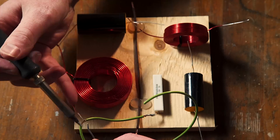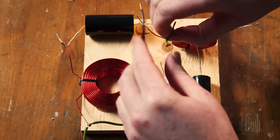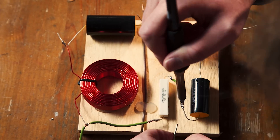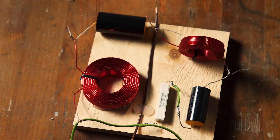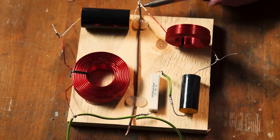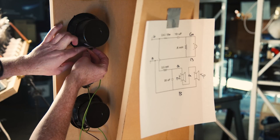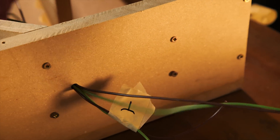When building a crossover with multiple inductors, it's important to set them up so the inductors don't talk to each other — not due to any fear of a machine uprising, but rather to prevent the two coils from creating mutual inductance by being oriented in the same direction. To avoid that, we're going to lay one horizontally and the other vertically. Then once you've soldered all the connections between your inductors, capacitors, and ground, you can place the crossover in the cabinet, mount your speakers, and wire it all together. To avoid excess wire cluttering up your interior, drop wires down from your speaker and cut them at the appropriate length to meet up with your crossover.